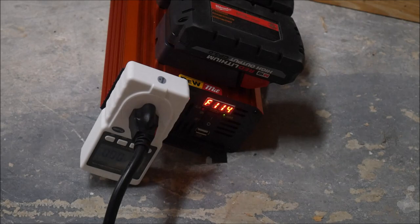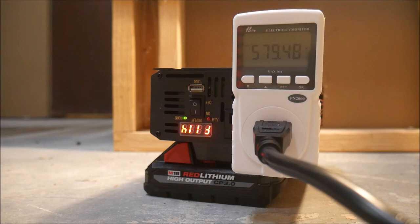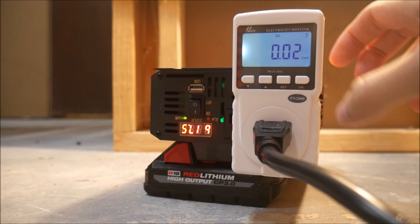Unfortunately, due to the orientation of the receptacles, the power meter is upside down, so you won't be able to read the numbers very well. First, I simulated the max continuous load of the inverter with two heat lamps and the 100 watt light bulb. I let it run for several minutes with no problem at all. The cooling fans on the back of the inverter didn't even come on once.